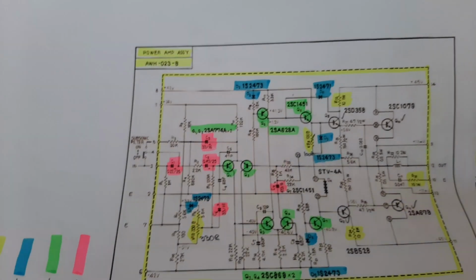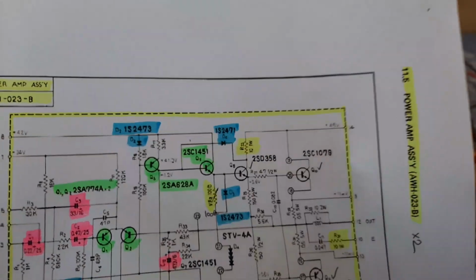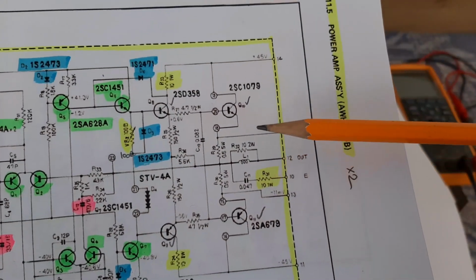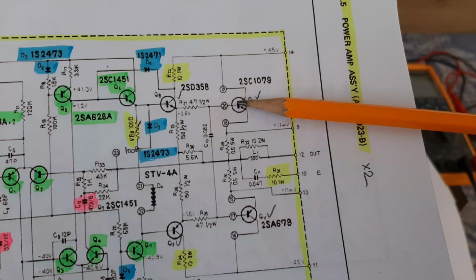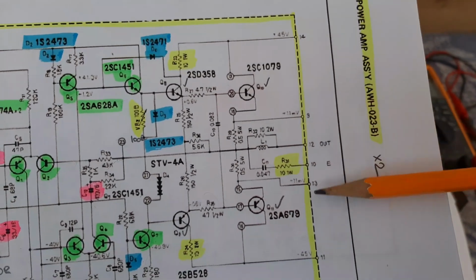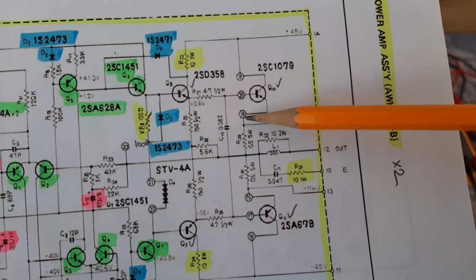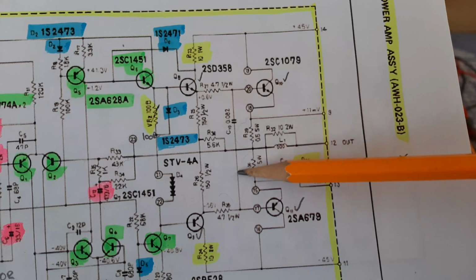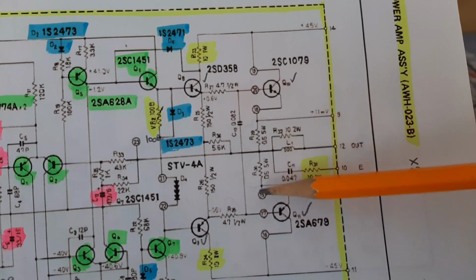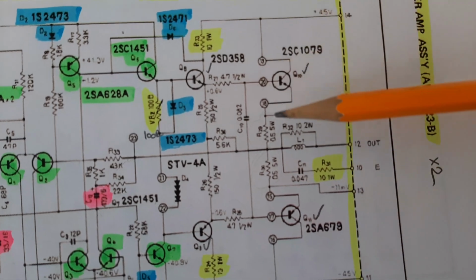So now let's take the wiring diagram and see what terminal 13 and terminal 9 mean. So we have here the power output transistors, yeah? Q10 and Q11, terminals 9, terminals 13. So you see, if you go like that, you will close the circuit through R29 and R30. So these two are the emitter resistors, which belong to the power transistors, yes?